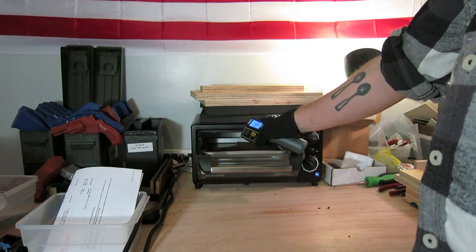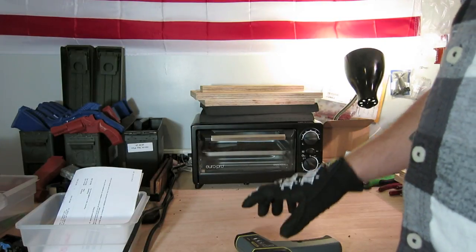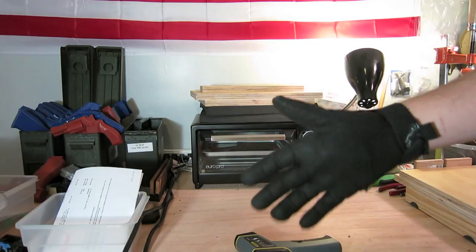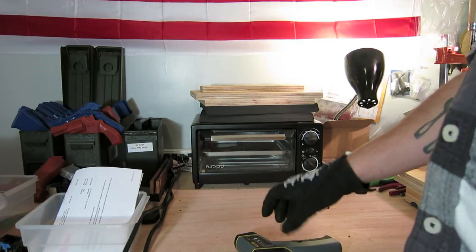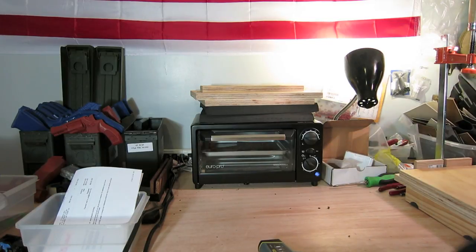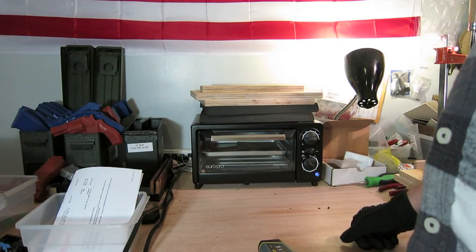If I were to preheat the oven all the way to 350 degrees and then put the Kydex in there, it would shrink and get really shiny because it can't handle that kind of sudden temperature change. In a dorm-sized toaster oven, I'm subjecting this material to a lot of direct heat. So initially I'll turn it up slowly, and as I get above 200 degrees and past 280, I can turn it up faster without likely shocking it. Just take your time and monitor your temperature — once you get to about 350, then you put it in your press and move on.